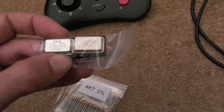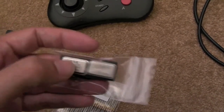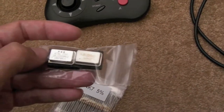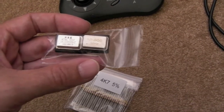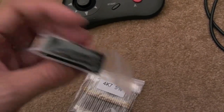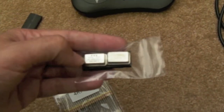In one of the previous pickup videos I mentioned that the 16MHz upgrade for the ST didn't require a crystal, but it does. It makes perfect sense now I think about it — if you tried to divide the existing clock and derive a 16MHz signal using flip-flops or something, there would be an inherent delay of however many microseconds, and that's going to cause problems on boot. You want everything synchronized right from the start at the origin, which is why that 16MHz clock is required and all the other signals are derived from that.